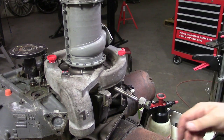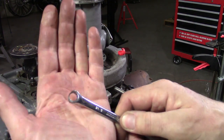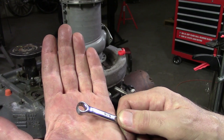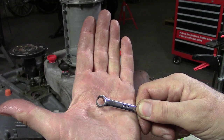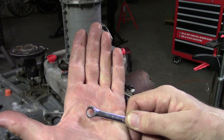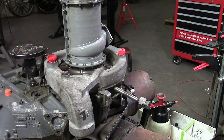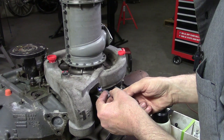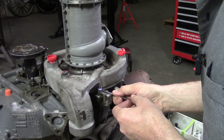We made a wrench - took an inexpensive wrench and ground it down so it fits. It's almost paper thin. I could have taken the side heels off a bit more, because it gives us basically one point of movement on a 12-point nut or bolt. Luckily, this was not an over-tightened bolt, so it came out nicely. We've got it to the point where it's basically finger tight, but I could only go about 30 degrees - 12 into 360 is 30 - that's how much movement I could get.